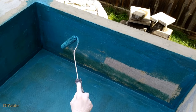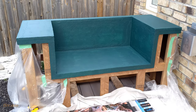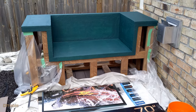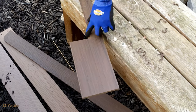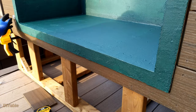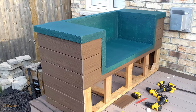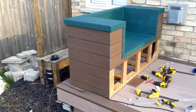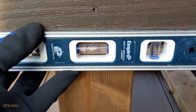Painting is easy. After the first coat is dried, you need to apply a second coat. Next, I am using the Azek PVC fascia boards to wrap around the barbecue station. For the installation, I leave one eighth of an inch gap horizontally for ventilation — that's very important for air flow. From time to time, you may want to check for leveling to ensure you have done a good job.